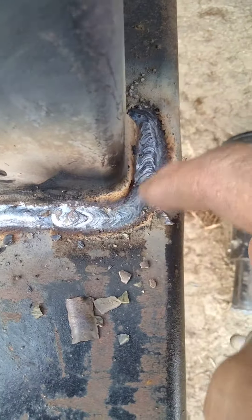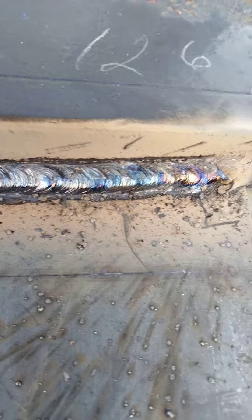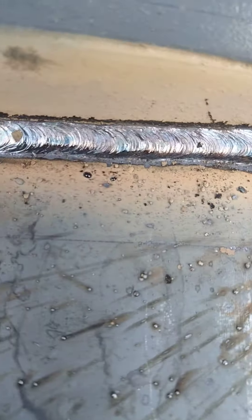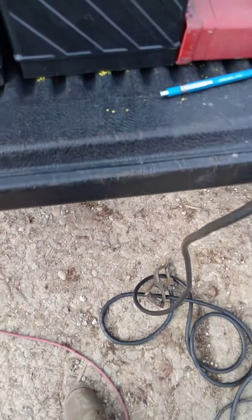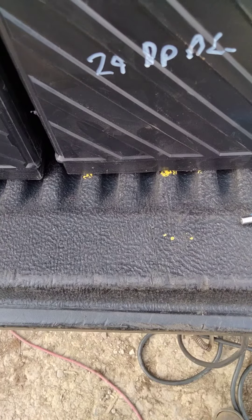That's part of why there's not that much color in this one — there's a little bit, you can't see it in the phone real well. But this one here, that's the right width, right arc length, everything was right on that — got really good color through it. So just something to watch for as you're dialing your stuff in. It's true with hard wire, dual shield, whatever. When everything's right, you'll get good color. Everybody be safe.